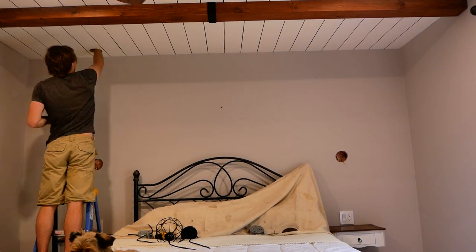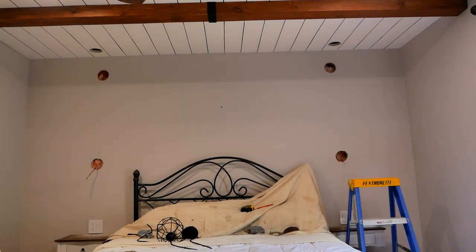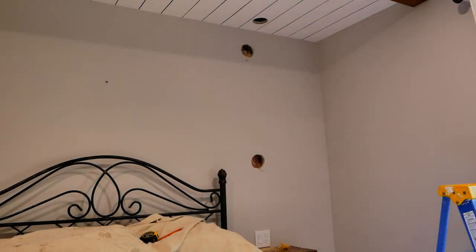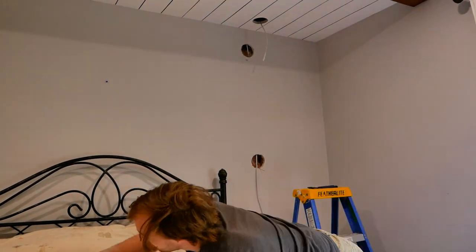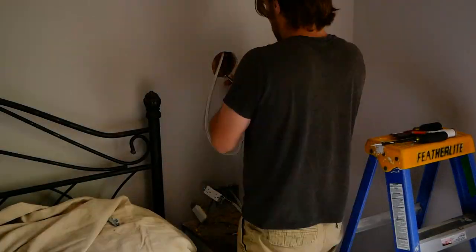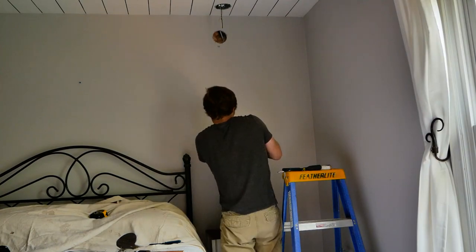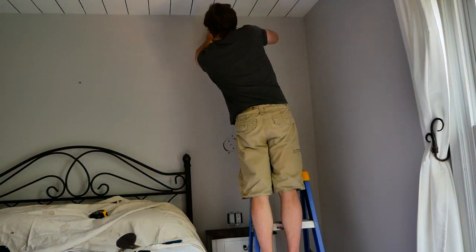Here is the process of changing a wall sconce into a pendant light. It's pretty straightforward — you have to drill out the hole for where your light will be, and in order to get through the top plate you're going to have to drill a hole higher up, closer to the ceiling of the wall. You drill a hole through the top plate and then fish your wire from the switch box all the way up to the light.